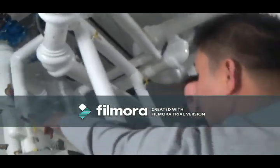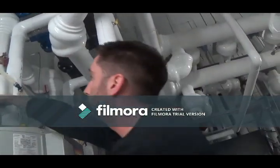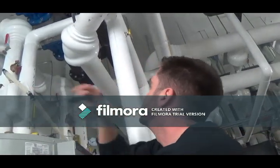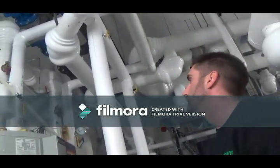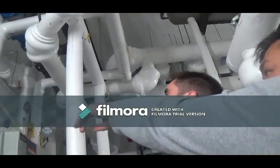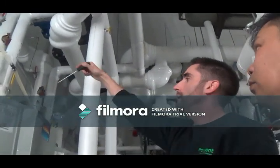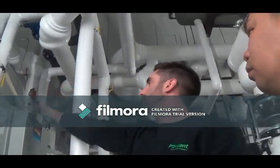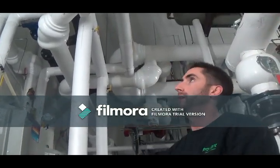See how you've got that? No, that's 140, maybe because the valve's closed. That's boiler water coming into the tank to heat it up, because based on the tank right there, that's the supply. So that's boiler water coming in, and I think this gauge is the temperature of the water inside there. I'm not 100% sure though.